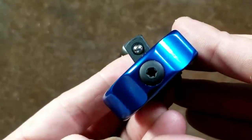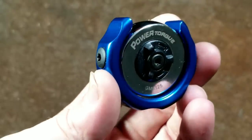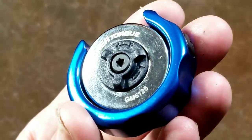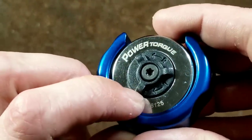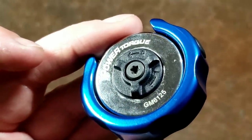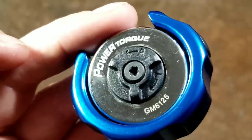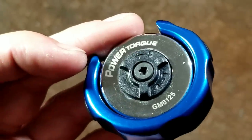The stamping is pretty well centered, which is not too bad. They use Torx fasteners — T20 star drive on each side and T15 for the ratchet wheel — to rebuild the ratchet, and it is indeed rebuildable. The reversing lever initially appeared to be plastic, but let me correct myself: up close it does seem like that reversing lever may actually be cast zinc or metal.